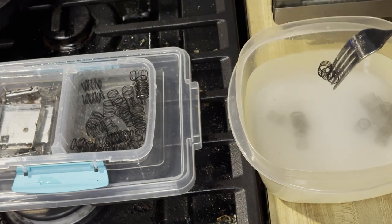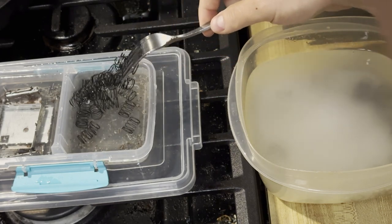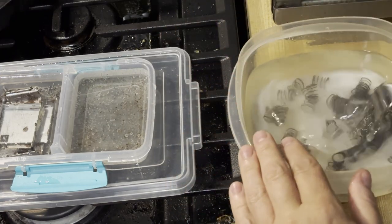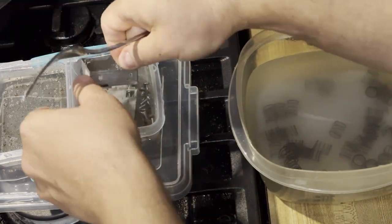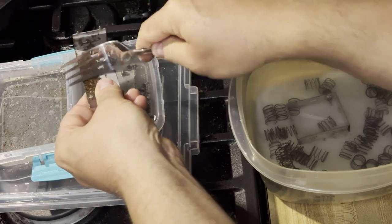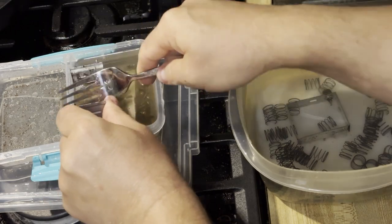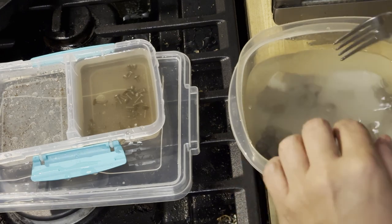The next day, I took all of the springs out of the vinegar and salt solution. I put them in a baking soda solution to stop the chemical reaction, so we don't deteriorate the springs any. Springs are in pretty good shape, even if they're darkened a little bit by the solution. I don't see any change on the RF connector yet — I think a steel brush will take care of that. Just me scraping here gently reveals that most of the surface rust came off of the cartridge shield just fine. We'll put everything else in there to let it finish de-rusting.